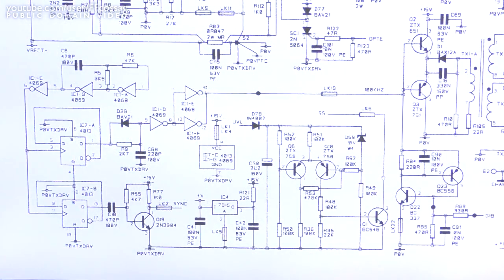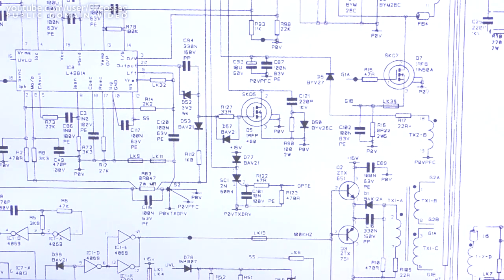What a bother. Alright, I've been going through the schematic and pretty much just picking parts which I think would be likely to be damaged by the failure mode we've seen here. At this stage I'm pretty sure it's been some kind of contamination underneath a PCB, piece of wire, some insect, something which has caused the horrendously strong flashover there. So if we have a go through it,